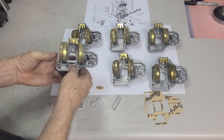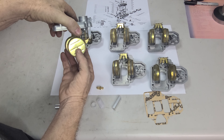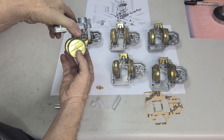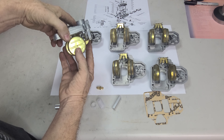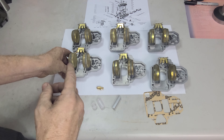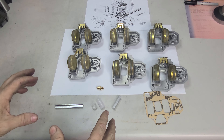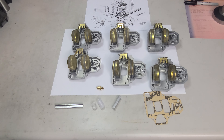So that's it on this little video. Once we get into the metering valve, we can adjust for the float drop — that lets the fuel in — and then for the valve to shut off at the top. Those are things we'll handle a little bit later, but first we have to take care of getting the floats in as good a condition as we can. Please like and subscribe and I will see you on the next one.